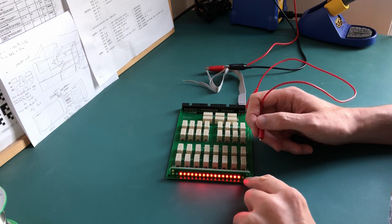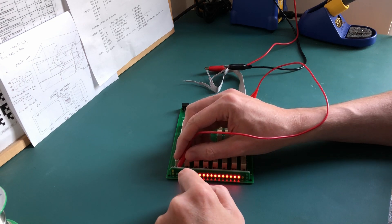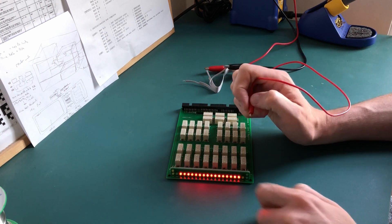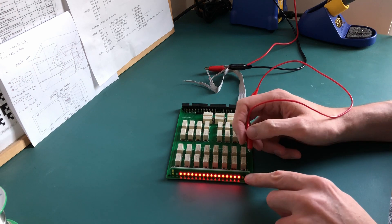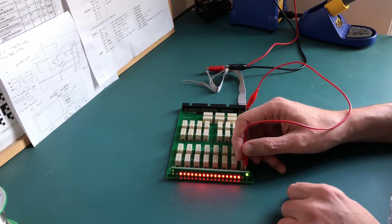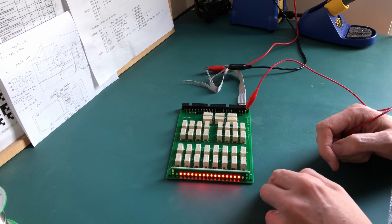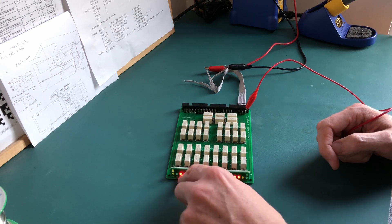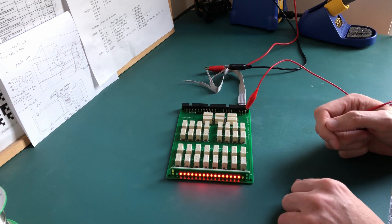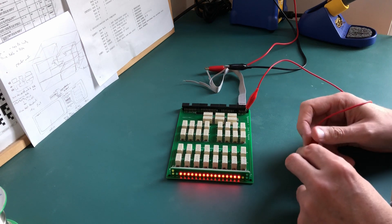And the only other logic then is the select low, which selects the lower values on, and the select high. So again if I go for that — that's effectively just activating the gating, but it doesn't lose any of the values on the register. And then the other one is the select both, which gates both onto the address bus. So the idea basically is here you can gate whatever values are on here onto the address bus — that's a 16-bit value — or you can select the lower half onto the data bus, or the upper half onto the data bus. Likewise you can load the upper half from the data bus, the lower half from the data bus, or load the whole lot from the address bus. That's why this 16-bit register is so flexible.